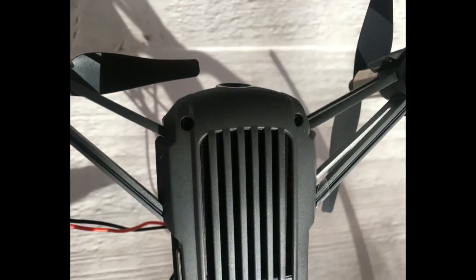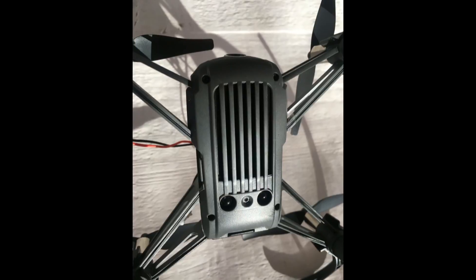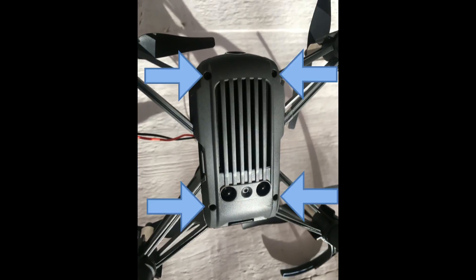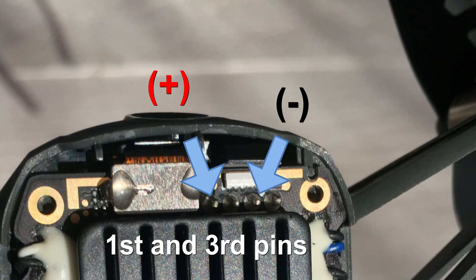As an option, you could wire the camera directly to the tele's power by unscrewing the bottom cover at the four points shown here, then soldering the camera wires to the plus and minus connections, thereby eliminating the separate battery.